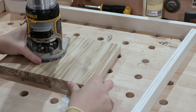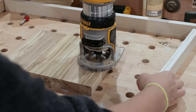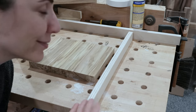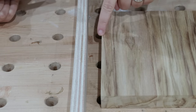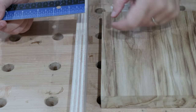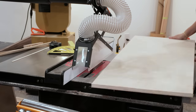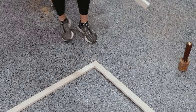I did a similar situation as before and lined up the edge of the bit with that mark, then put the fence next to the router, moved the router away — and of course you could do math, but why do math when you could do it like this. The difference here is that I'm going to measure from the edge of the board to the opposite edge of the fence, so I want to include the thickness of the fence, and that ends up being an inch and five eighths for me and my router base. So I ripped some more strips of plywood to that thickness.